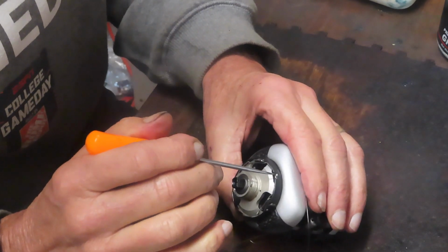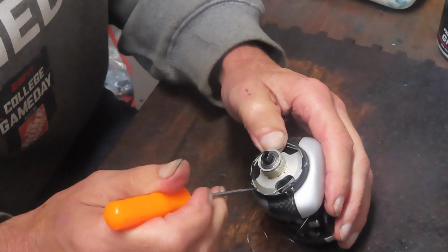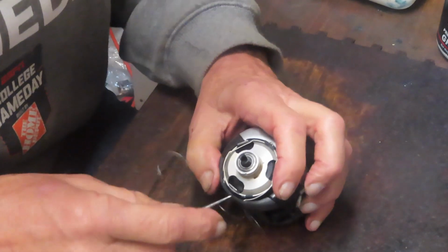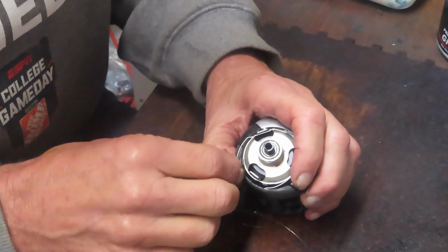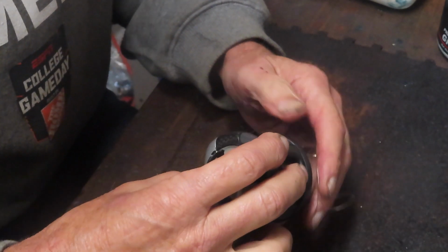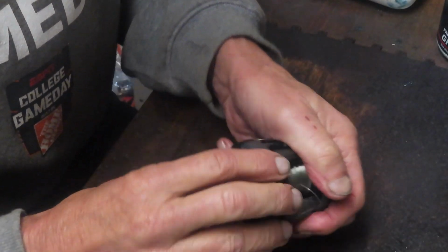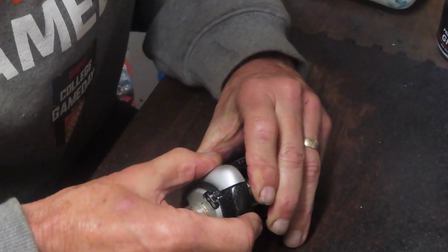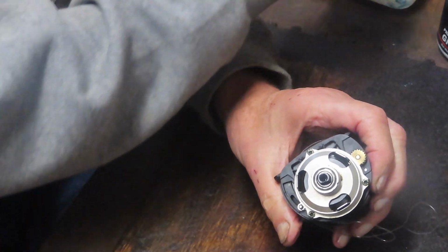It's a little tag end that's sticking up through the thing, kind of a retainer clip. And it looks like we can just remove that by simply getting both sides of these legs out. And again, I'm dependent on the schematic here, but hopefully everything else will go kind of smoothly. It's been going smoothly so far. I believe with that clip out, this should just pull off. At least it appears that that's the case here. Just simply pull off. There we go, that's off.